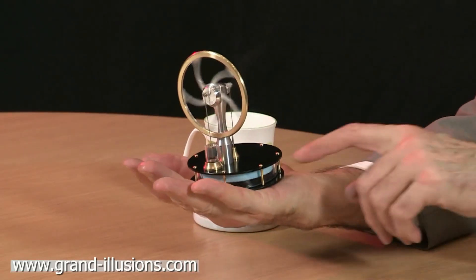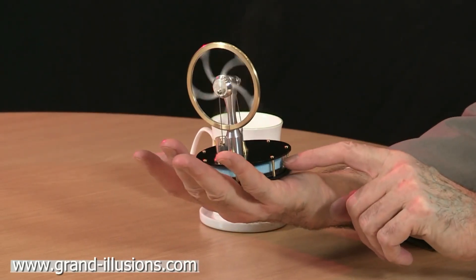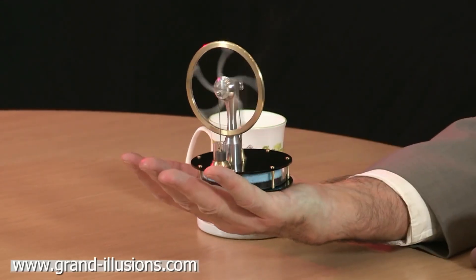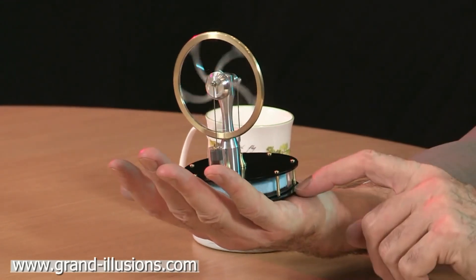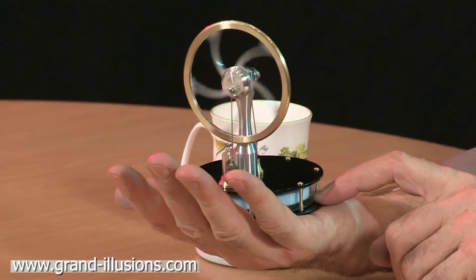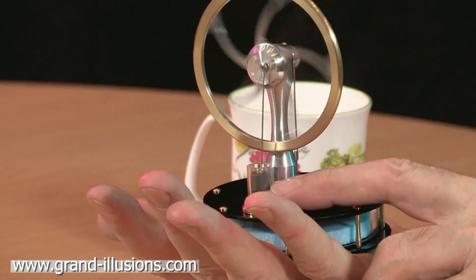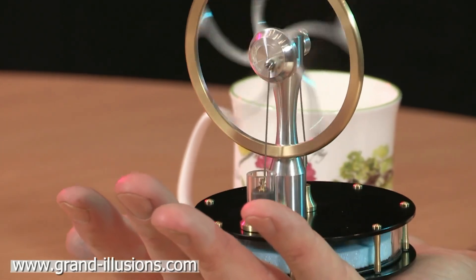So we're getting a little displacer here, it's pushing the air up and down. When the air is in touch with the top plate, which is quite cool — this is the temperature of the room — it contracts. And when the air mixes with the bottom plate, which is quite hot now, it's going to expand, and the pressure of the air is pushing that piston up and down.